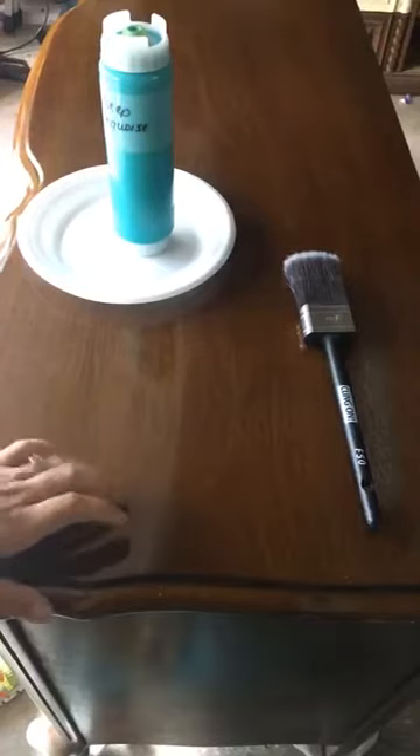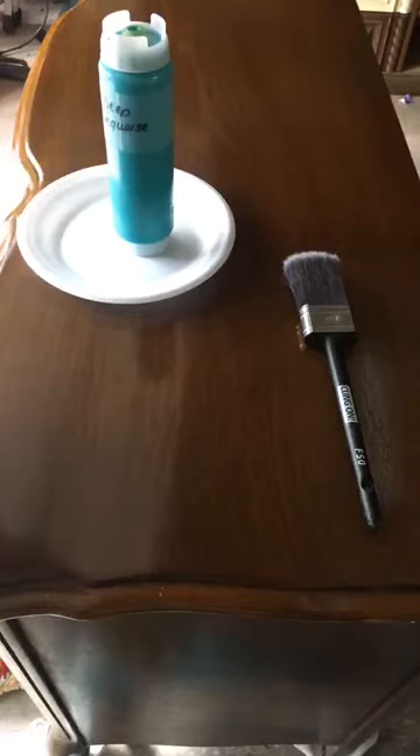If I decide to sand back and reveal any of this wood during the process, sometimes you can nick it down to the wood, and if that's the case, then you're going to have a lot of that wood tannin coming through. You can have oranges and pinks and yellows peeking through your beautiful paint - we don't want that to happen. The shellac is going to help ensure that I don't have that take place. It stinks when that happens because you've got this beautiful piece of work and suddenly that bleed comes through - it's just so saddening and maddening.